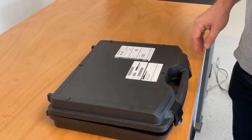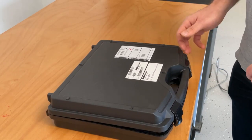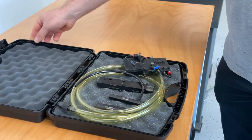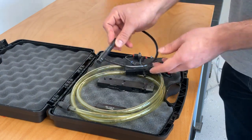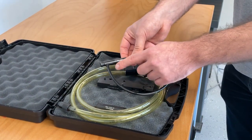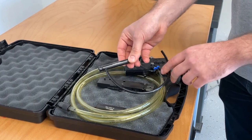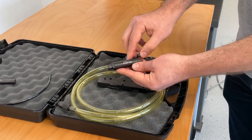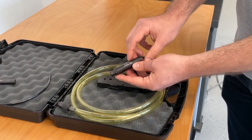First of all, we are going to show you the parts that most auto feedings consist of. All those parts are identifiable by their Haeger serial number shown on the part itself. The punch of an auto feeding system additionally has a hose to connect to the vacuum system. Also, the bottom tooling is marked with the Haeger serial number.